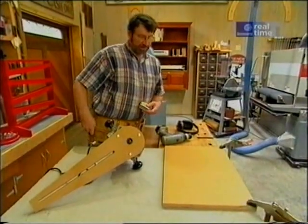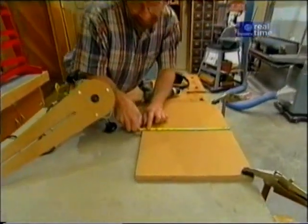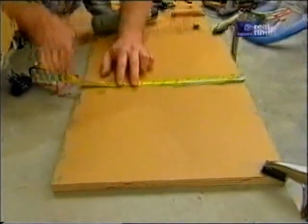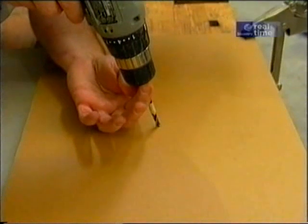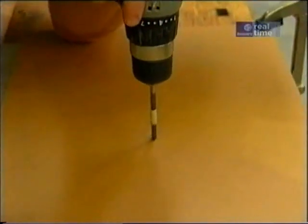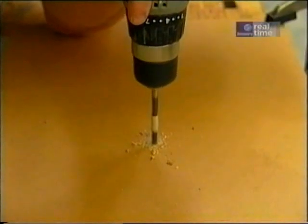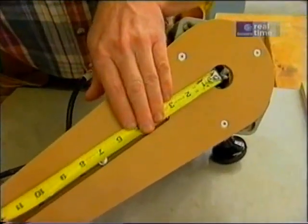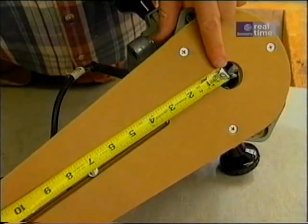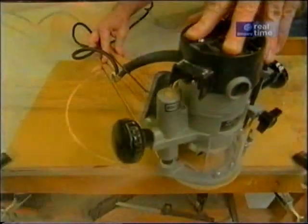Let's make a test cut. I've got a piece of three-quarter-inch plywood here that's about 14 and a quarter inches wide, so I'll put a mark right about in the center. I'm going to cut a 14-inch diameter circle. Now I'll take a quarter-inch brad-point bit and drill a hole partway through. For the setup on the jig I've locked down the pin so that it's seven inches from the center of the pin to the leading edge of the bit. Now I drop the pin over that reference hole and a couple times around — it should cut all the way through.